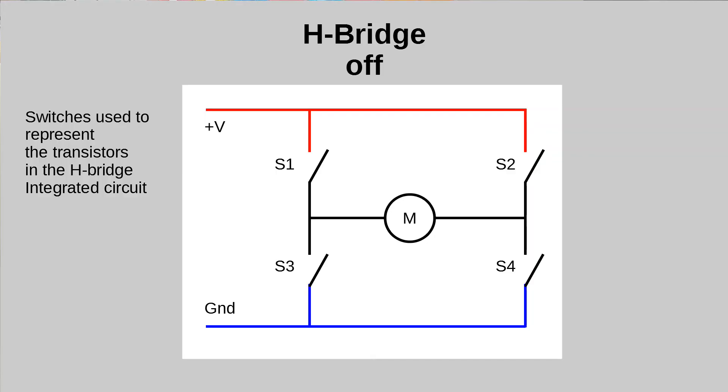The solution we're looking at here is the H-bridge controller, which is a standard technique for changing the voltage direction for a DC motor. Internally it consists of four transistors — you turn the diagonally opposite ones on and the voltage goes in one direction, then switch to the other two and it goes in the opposite direction. This is best seen by looking at the diagram.